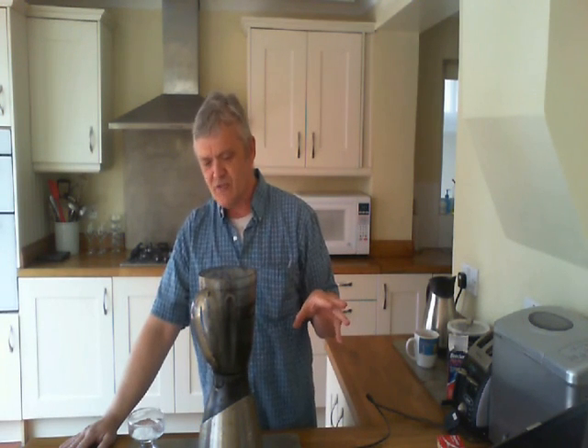These researchers used industrial machinery, but as part of their work they also bought a Kenwood blender — just a household blender, which is what we've got here. In here is 50 grams of micronised graphite powder. The micronised graphite is 5 microns or less, but you can use up to 350 micron graphite powder, and you can vary the amount between about 20 grams per litre and 100 grams per litre. I've chosen 50 grams per litre.